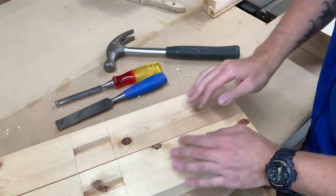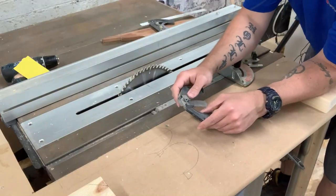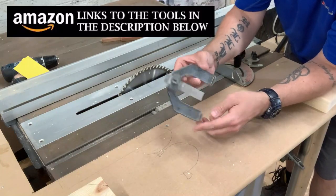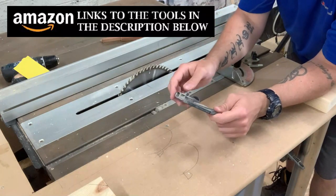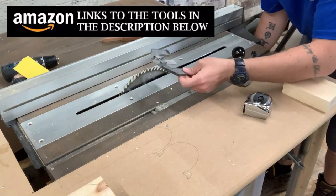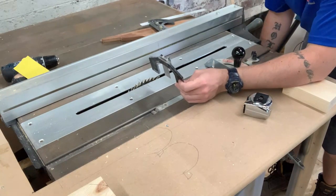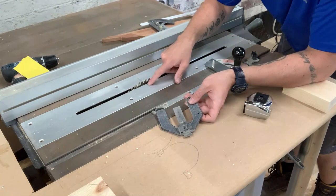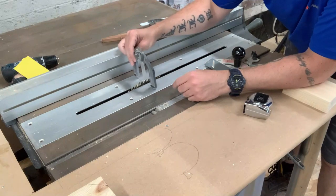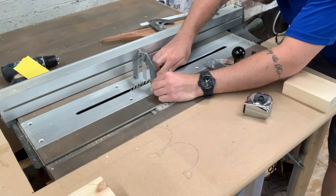Now for the tenons. I'm going to use my table saw because I've got one and it's the easiest thing for me to use. I need to set the blade height to 10mm. These little depth gauges are great — mine's covered in overspray from spray paint so it's a bit hard to see, but they are good. I'll leave a link in the description to my Amazon shop so you can get one — great for setting up table saws, routers, spindle moulders, anything really. I've set the depth gauge to 10mm and raised the blade up to it.